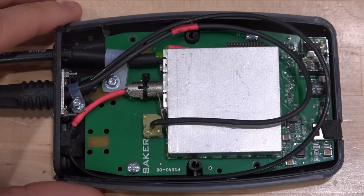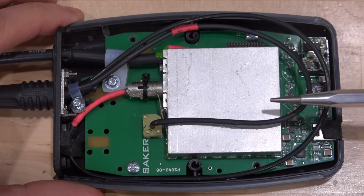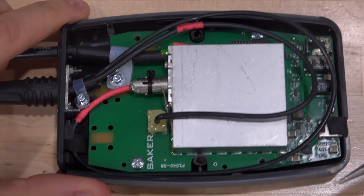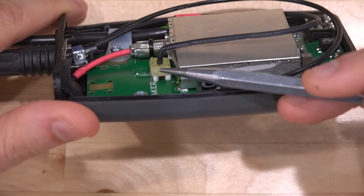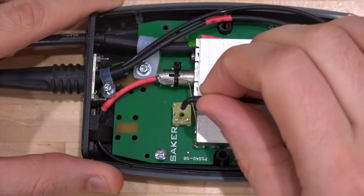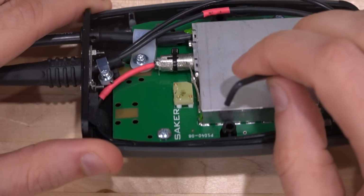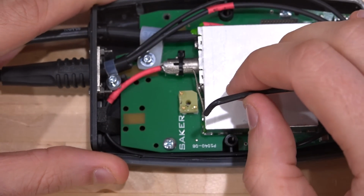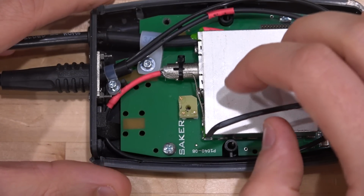Very cool to see. Now this thing, as I said, does have a bidirectional fiber connection for the calibration and so on, sending messages back and forth. That's a digital interface in a sense, and it looks like they have made a custom little interface there. Kind of clever, nice Spanish engineering. And this fiber with a fairly large aperture just plugs into that, and underneath it we have a pair of transmit receive detector and emitters there, which is used to do the digital communication.